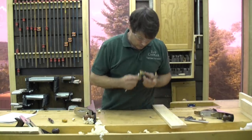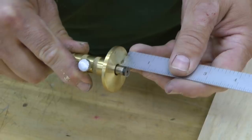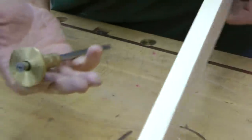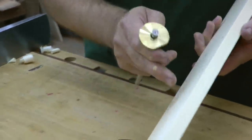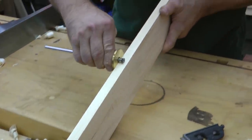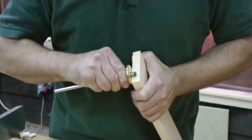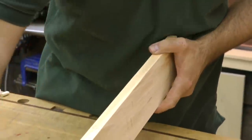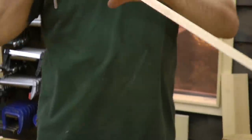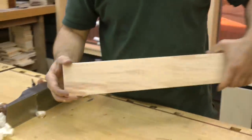So I will take my marking gauge. Rick, you want to come in close on this. I am going to set my marking gauge for three-eighths of an inch. Now what I am going to do is scribe all the way around, and I am going to reference off of — work off of — the reference face. A nice deep line just makes it easier to see. This one is going to be a little bit difficult because this is the end that I couldn't scribe — I couldn't get my reference faces against the fence.